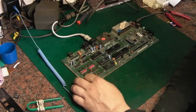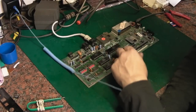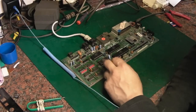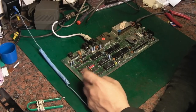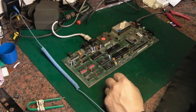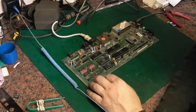It's not something as simple as, I mean, that's the first thing I did with these things when I got the whole lot of them. Once I got one working, I could ascertain which of the socketed chips in the other ones worked and which didn't. I made two big piles and started building up computers using the known good chips. That got most of them working, and obviously there are ones that have a fault on the socketed chips. I was just doing them as and when, so they went right to the bottom of the pile, and that's what we're dealing with here now.